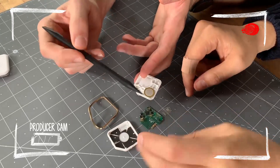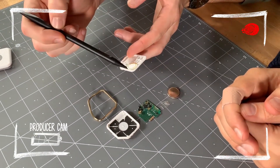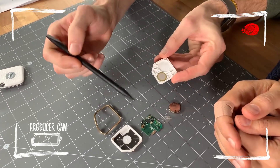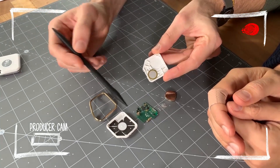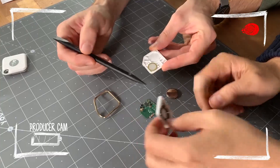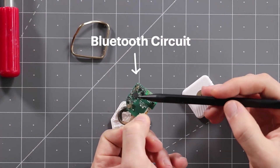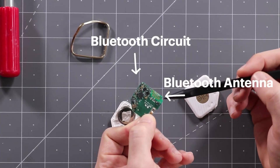Just some component callouts. That's the speaker — it's a piezo element. What's amazing is that they're doing just a press fit to create the electrical connection to the board to drive it through that connector. The entire Bluetooth circuit is just positioned on the corner here. There's the Bluetooth — the meandering Bluetooth antenna.